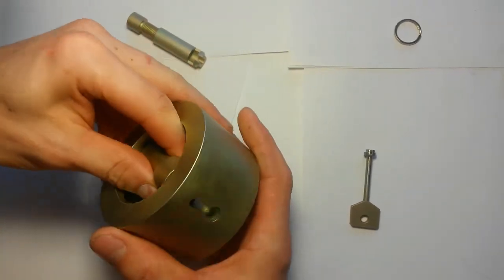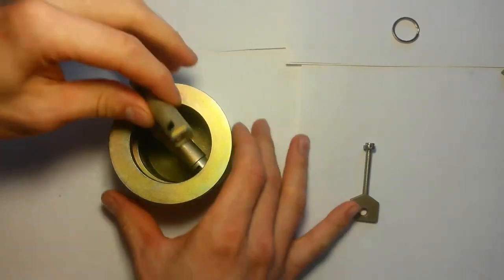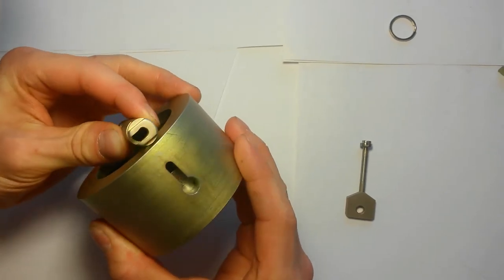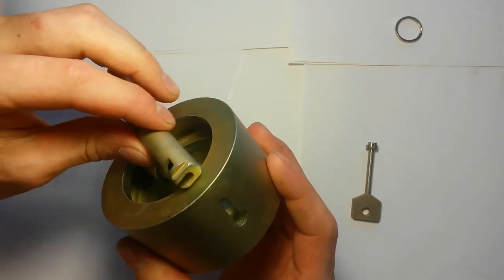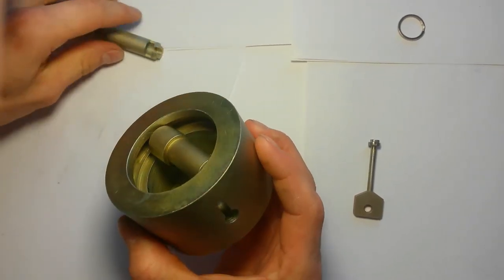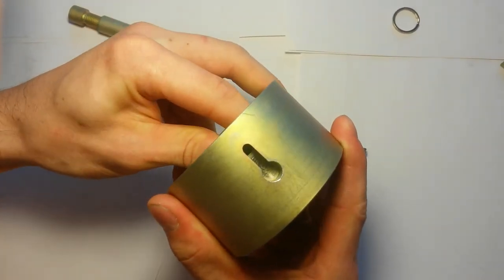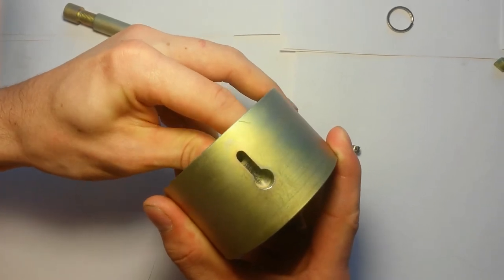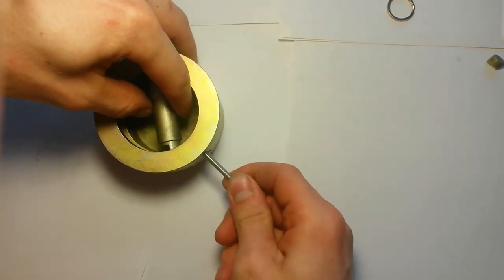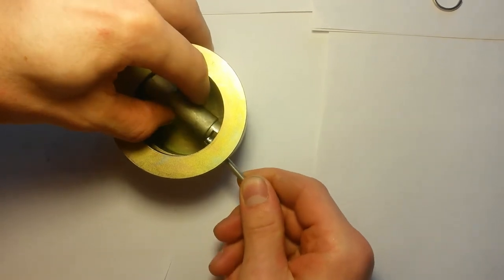After we have wedged the screw on one side, we need to turn the case to the other side, but not exactly 180 degrees, but about 160, either above or below. Since the nut is fixed only in two positions, its groove will be either at the top or at the bottom. To determine its position, you can look into the hole for entering the key, but it is better to immediately get used to acting by touch. For example, try first from the top, blocked, take out the key, try from the bottom.